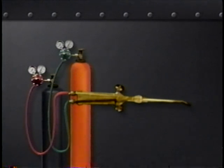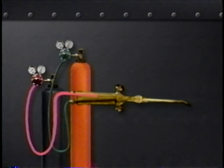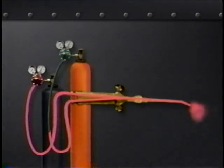When the acetylene valve on the torch was opened, acetylene went into the mixing chamber, and part of it went out the tip to be burned. Since the acetylene had 5 pounds per square inch and there was no oxygen pressure, acetylene backed up on the oxygen side. Since the oxygen valve on the torch was open, it went right on back to the check valve. What the man had no way of knowing was that a bit of grit had gotten into the system and the check valve was stuck open. So the acetylene went right on past the check valve and into the hose and back to and through the oxygen regulator. Remember, he hadn't shut off the regulator.